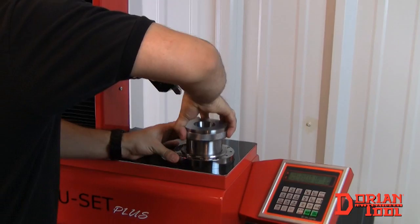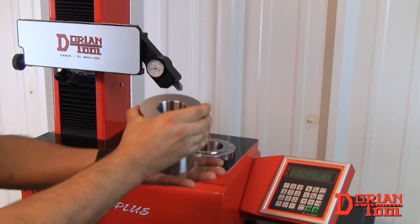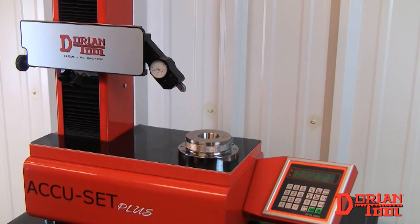The tool sleeve is interchangeable, so you can measure tools with various V-flange holders. This presetter measures any tool diameter and length by using a spring-loaded probe and indicator to correctly gauge the dimensions of the tool with an accuracy of 2/10,000ths of an inch and a resolution of 5/100,000ths of an inch.